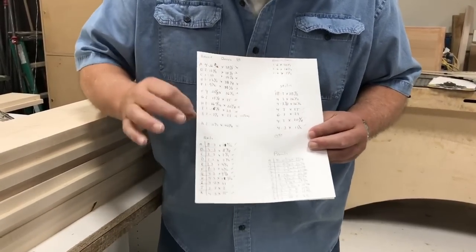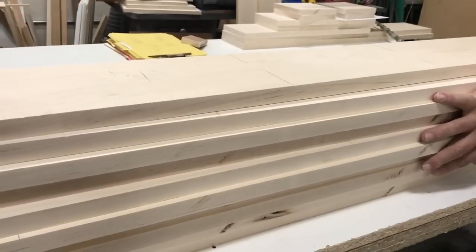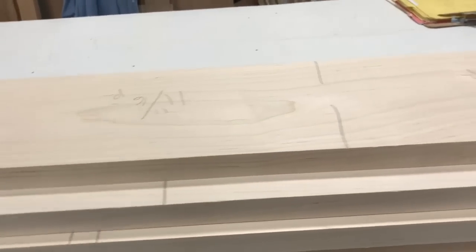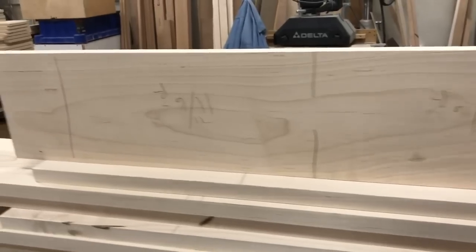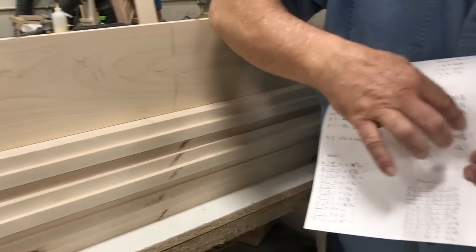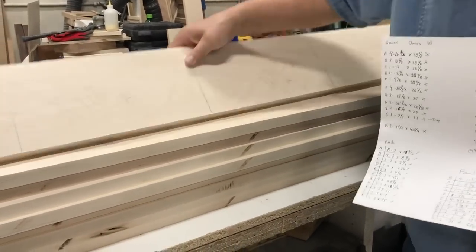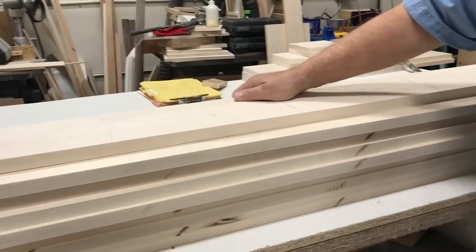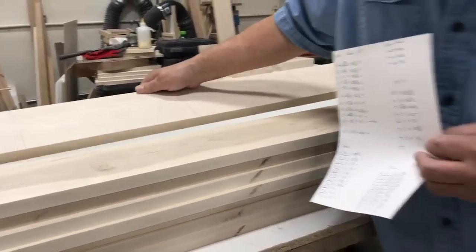Remember our worksheet? We've listed all of the parts. What I've done with all of my lumber is milled it to thickness. Styles and rails are three inches, but I've cut all my stock to six and a half inches — I'll show you why in just a minute. I've gone through and marked all of my boards with the pieces I need so I can mark them off on my sheet as I mark on my wood. Each piece in my stack is marked with size and I've made it a little long so I can chunk it off on the chop saw and trim it to square with my box sled on my table saw.